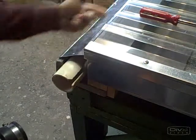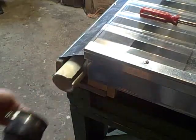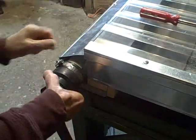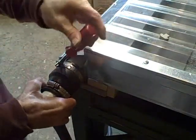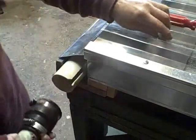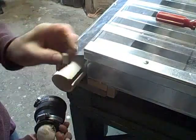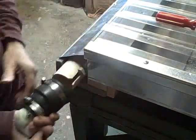We have our gutter in place — we slid that through our bibs — and this is where the water is going to be collected for the MTD collector. We're going to attach this 2-inch boot to the end of our PVC gutter like this. But if that's all we do and we tighten this down, it's going to compress the gutter and we'll get some leaks. So we have to hold the PVC pipe stiff so that when we tighten it up, it won't compress the gutter. This is what I call a compression slug — we just slide this slug in here, and that will prevent the PVC pipe from compressing.